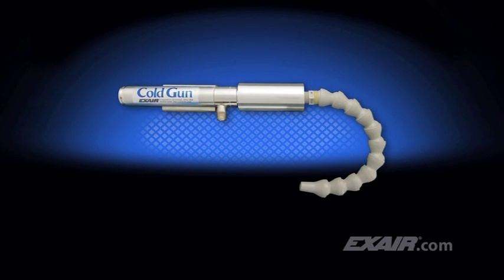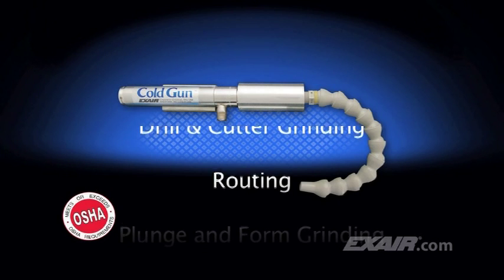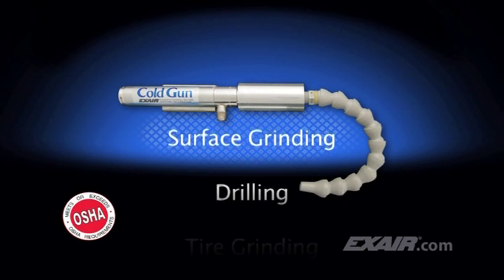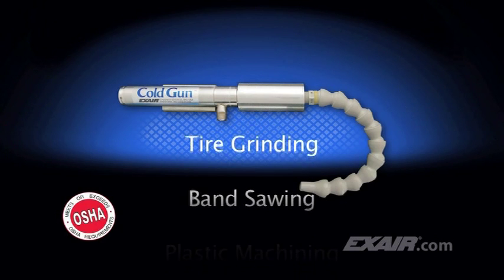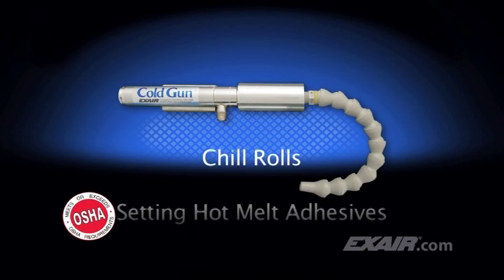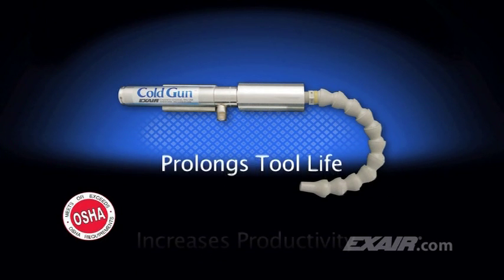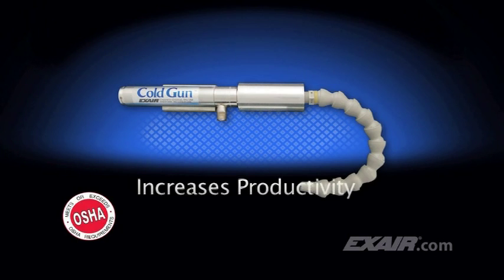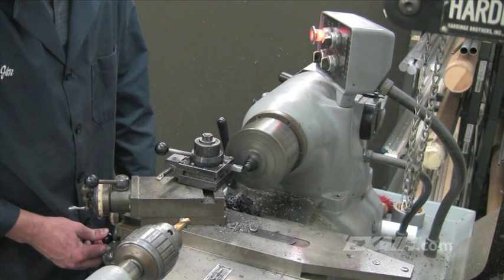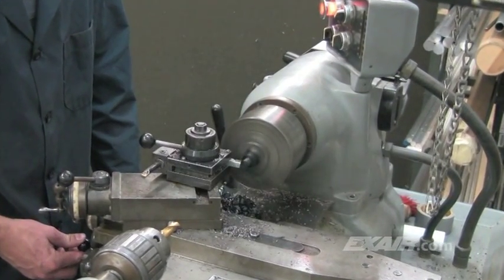The cold gun is ideal for drill and cutter grinding, routing, plunge and form grinding, milling, surface grinding, drilling, tire grinding, bandsawing, plastic machining, laser cutting, for chill rolls, and setting hot melt adhesives. It'll remove heat to prolong tool life and increase the productivity on the machining operations when liquid coolants cannot be used. The cutting, drilling, sawing, and machining of plastics can be a real problem.